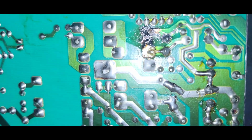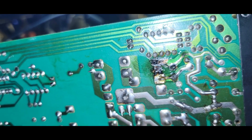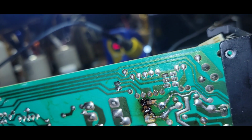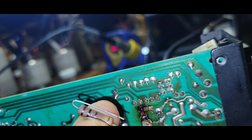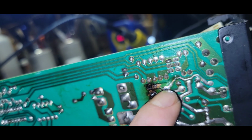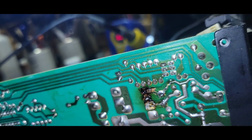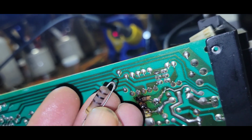I wonder if... Yeah, I'm going to have to search and see if I have something, same, 100 ohm, just like this. Right, that's in much better shape. God, it's going to have to be just like that, because I'm going to need that much leg on one side. Unless I go from the bottom and jump it this way from here to here, and just bypass this nastiness and this nastiness. But again, that's not like a quarter watt or half watt. That looks like a full watt or 2 watt